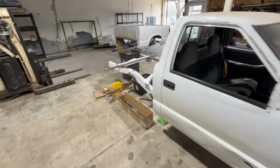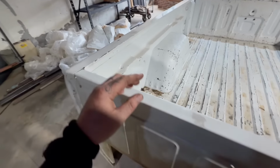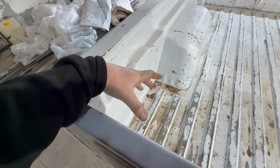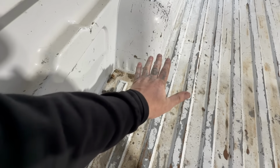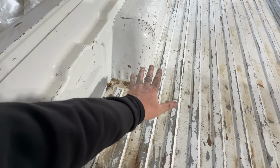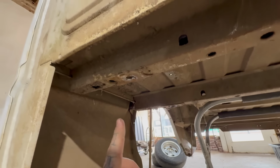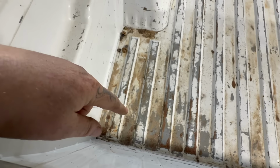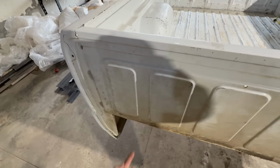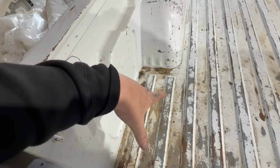We're also going to be scanning our bed today, so that I can make what I'm thinking of as a sheet metal, kind of badass looking piece. It'll be basically a plate with some supports up to another plate that is the dimensions of a turbo flange, where you basically drill a hole right up through this thing right here, which is your bed mount. You'll use a small bit to go through that, locate a hole up here, and then you can drill that hole out and run one long bolt up through, or a piece of all thread bolt, to the turbo mount I'm going to make.